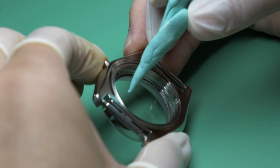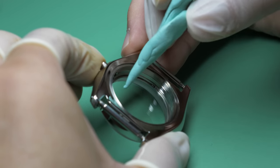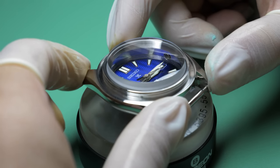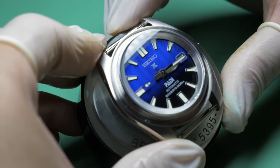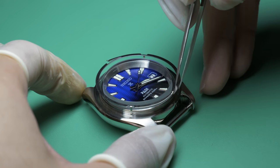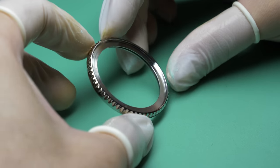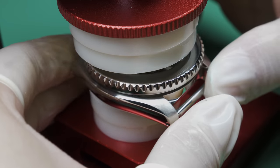It's so important to have a clean watch. I keep a separate case of Rodico and a bunch of other tools just for crystals. Here comes my favorite part — the casing. This step always gets me excited since the watch starts to take shape. Once they're married, the case is temporarily closed up to install the bezel mechanism, and I chose to use an oyster style bezel for this model. The gasket is lubricated, put into the bezel, then set onto the case.